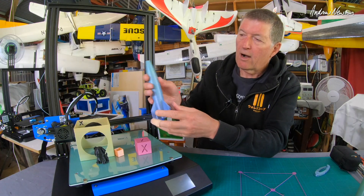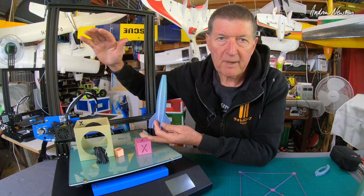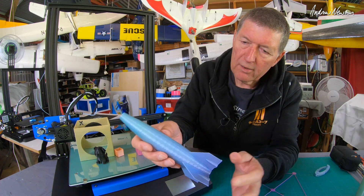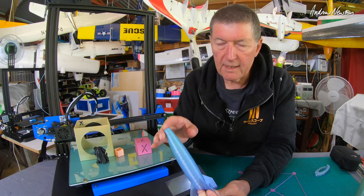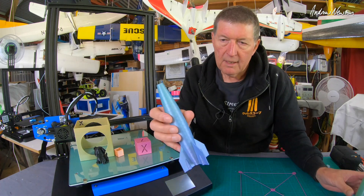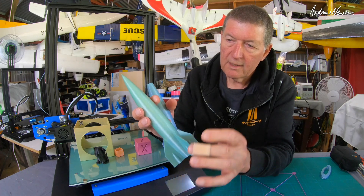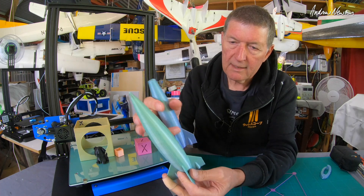Next I did something a bit higher. To do a full-size print it's always going to take about 24 hours, so I haven't been game enough to do that yet. But here's a rocket, about that high, and this one the infill showed through the walls — that is mainly due to the Cura profile. There is an ET5X profile included with Cura and I just used that as-is. To improve the infill showing through, I changed the setting to print the walls before the infill, which improved it quite nicely. There's a bit of a seam down the back, but you can get rid of that with a random line start.